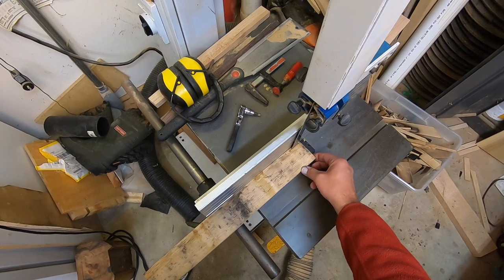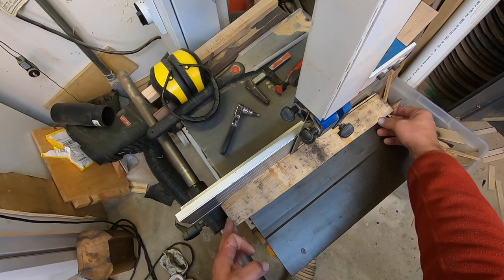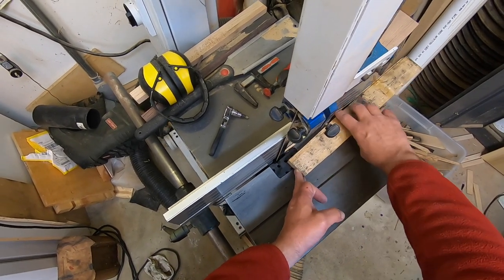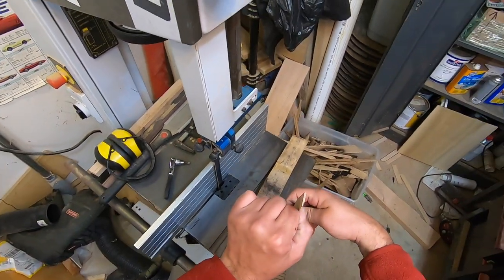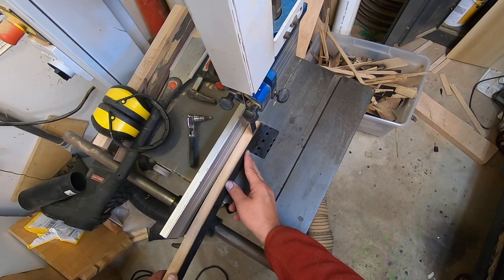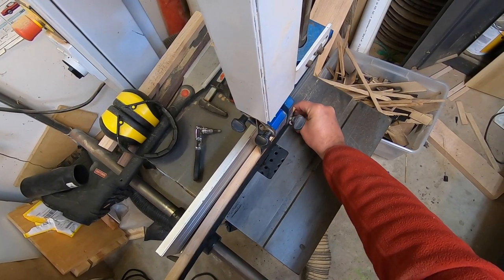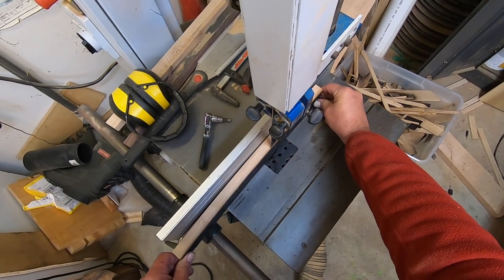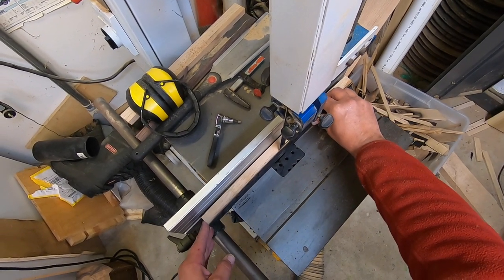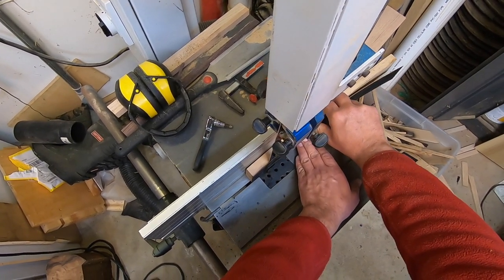The tricky piece is all the barrel staves have a taper on them to fit together, and I've got to cut that off. So I slowly go through and cut that edge off so it's flat, releasing a lot of the tension in the wood by trimming all of this up. You can see that taper on the barrel, and then once we cut off that side I've got a flat side. Both sides are flat, and what I'm going to do is cut off the char - this is going to release a lot of the tension in the wood itself. I'll put a new blade on my saw and go through slowly for all the pieces.